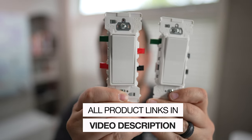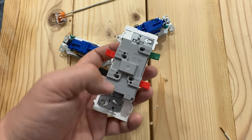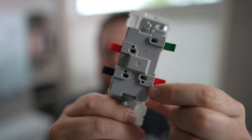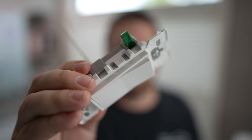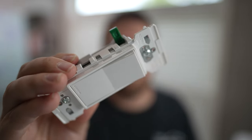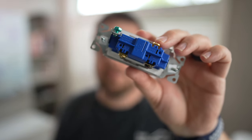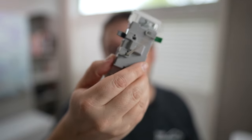In addition to a single-pole light switch, Leviton also makes a three-way version. It has color-coded levers — the red tabs are for the travelers and the black one is for your common wire. On the back they've included test ports, so once it's wired up you can still insert a multimeter probe to check everything is wired correctly and troubleshoot if needed. The fact that they've also included a lever and connection point for the ground is a really nice addition, because even if you're used to the backstab method you still had to make the ground connection with a screw — this totally eliminates that.